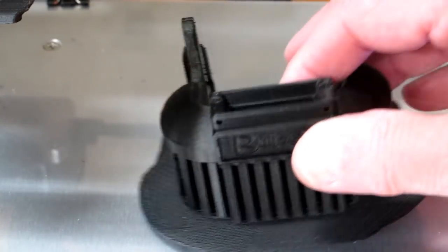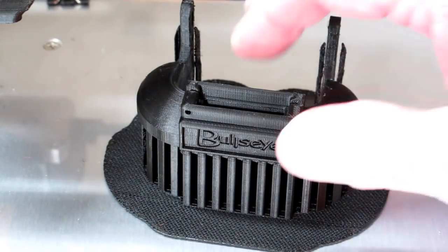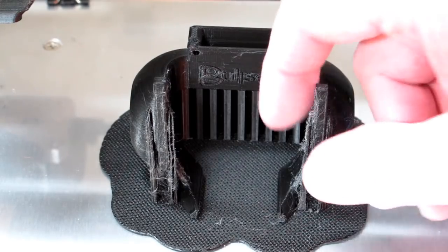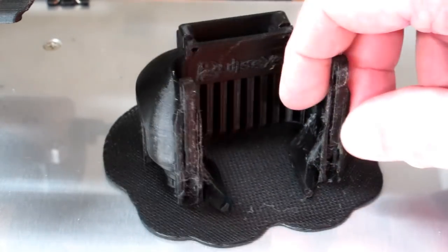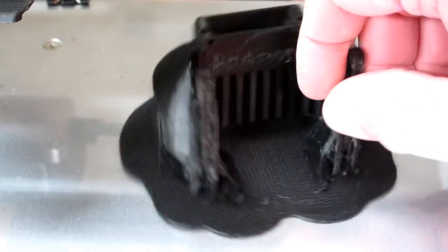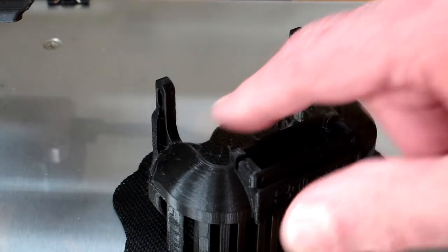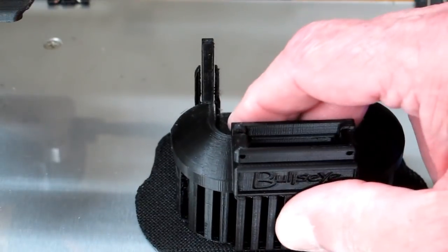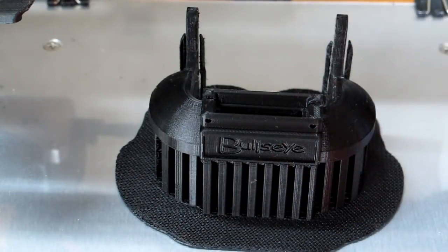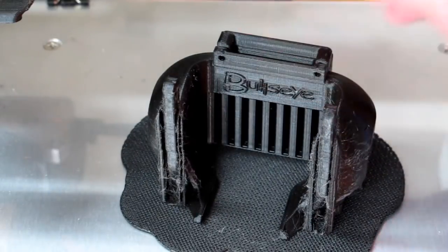This sticks to the PEI pretty well — you do have to pry it off; it does not release when it cools off, even after the bed is cold. This is a pretty clean print, though I always get some fine stringing. My experience with Cura is it does not retract the filament when moving from support material to support material — it drags a fine thread. This time I used Z-Hop when changing layers and it didn't string as much, but there was still a fine thread. This is something you have to experiment with; everyone will need to find their own favorite settings. It's unrealistic not to expect some cleanup on these prints — that's just the nature of the beast.